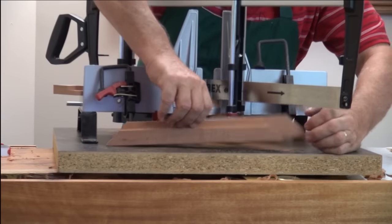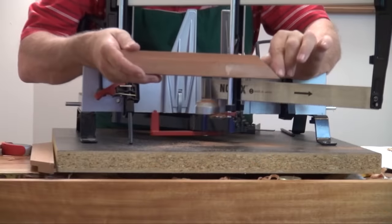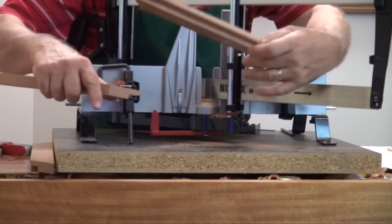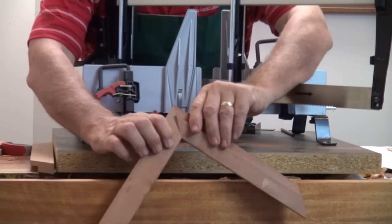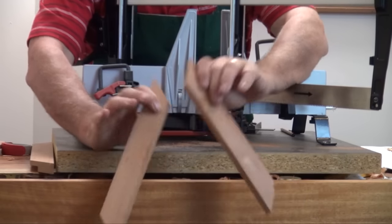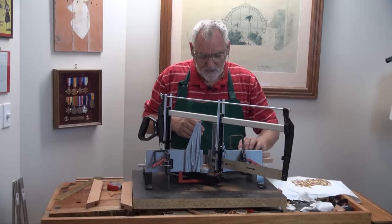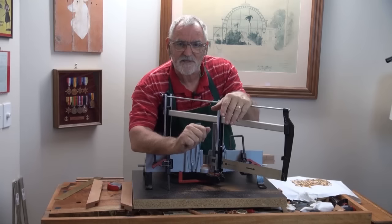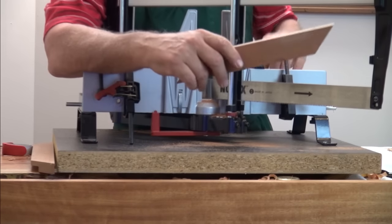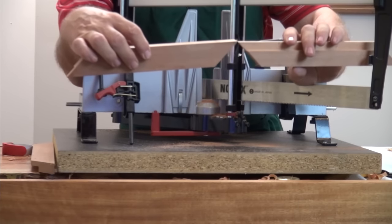There are the two that are going along the top and the bottom. Now measure how high you wanted. And bear in mind when you cut this mitre, it has to correspond. You don't want to cut this angle again because if you did and we put these together, you would end up with a rebate on this side and the front of the frame — really not a good look. And that's the reason you end up having it a lot longer than you think it is, because a lot of times you'll measure a picture and think that's the size you need, but then you don't allow for the width of the timber, and also when you're cutting the angles out, you're going to lose that much waste in the middle.